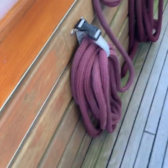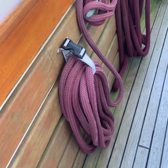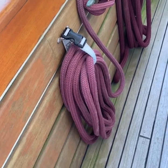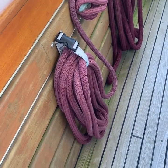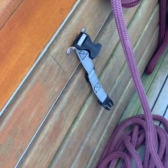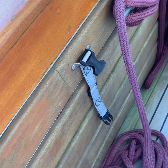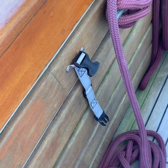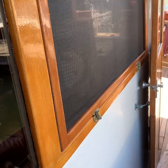The next thing I wanted to show you are these hangers that we use for the mooring lines. They're simple loops of nylon with plastic clips held through a footman's loop on the bulwark. The mooring lines are kept off of the deck and out of the way while we're either tied up or underway, but they're readily in place to be used should you need them. The hangers are simple nylon straps with three-piece plastic buckles that can be adjusted in length, held with a footman's loop. Now I realize people with a fiberglass bulwark rather than this wood trim would probably not want to drill into their fiberglass to hang them, but for us this is convenient. The screws are short and don't penetrate the fiberglass.